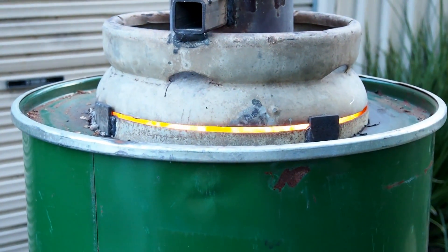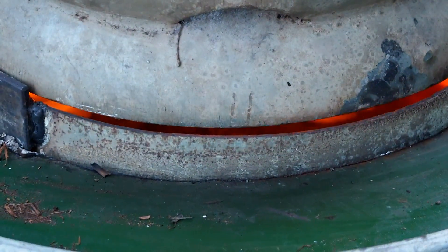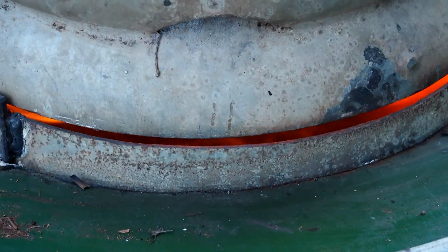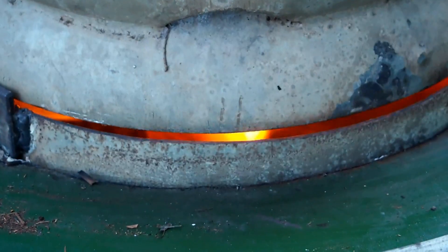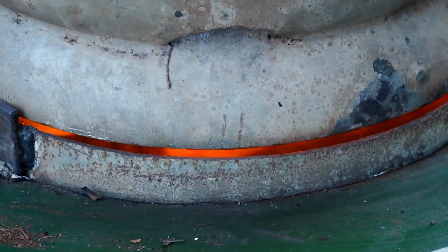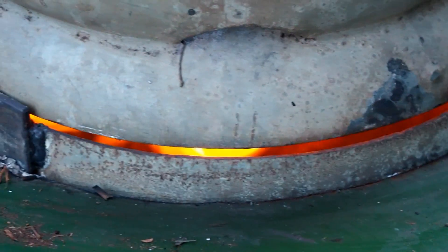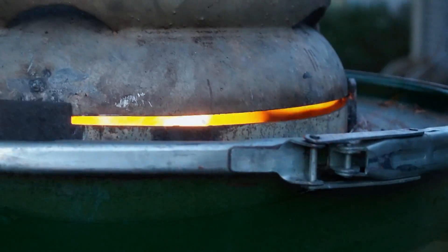The perlite insulation works quite well as a cheap reflective insulation. Ceramic fibre could be used but will greatly increase the cost. The biochar is put in an oxygen-less environment — as the char bank travels down through the biomass, the smoke rising puts the freshly charred material above into an oxygen-less environment, so the carbonization process is stopped and you get a very low ash content. The unit itself is drawing in clean air to mix with the volatile smoke, creating a nice, almost liquid-looking flame that is drawn up to burn in the flue.